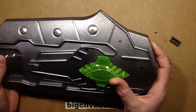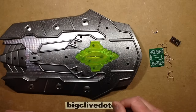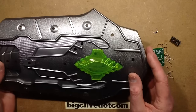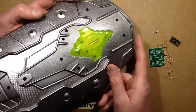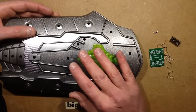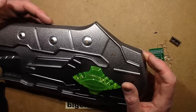This is a vac form plastic housing — a children's toy shield. I'm just using this as an example because I don't have access to a vacuum forming machine here in the Isle of Man. This could just as well be a fiberglass molding — it depends on the production. With fiberglass you have to drill holes and mark them out quite accurately, and you have to be ultra careful because each prop is a one-off. If it splits, that's an expensive fix.